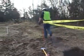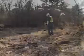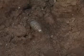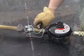During the bore, monitor its progress by walking the bore path and counting the tape markings on the supply hose. Upon bore completion, throttle the tool down and assist the tool out of the ground. This prevents debris from entering the tool.